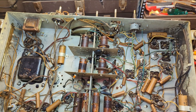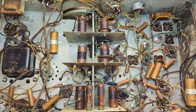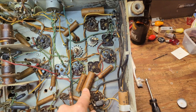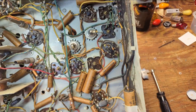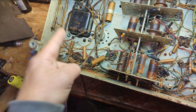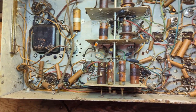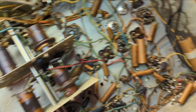It's not as bad as I remember it being actually — plenty of room to work in, and a decent amount of capacitors, not an overwhelming amount. In this 1930s era of RCA they would have these generically printed caps — you read them like '0.25 microfarads, 300 working volts' and so on. Counting them up: 1, 2, 3... 19 caps total. The only one that looks like a real pain is this one right here, but I can find another ground close by. We also have an electrolytic here that's 10 microfarads, and another one that's probably also 10 microfarads.